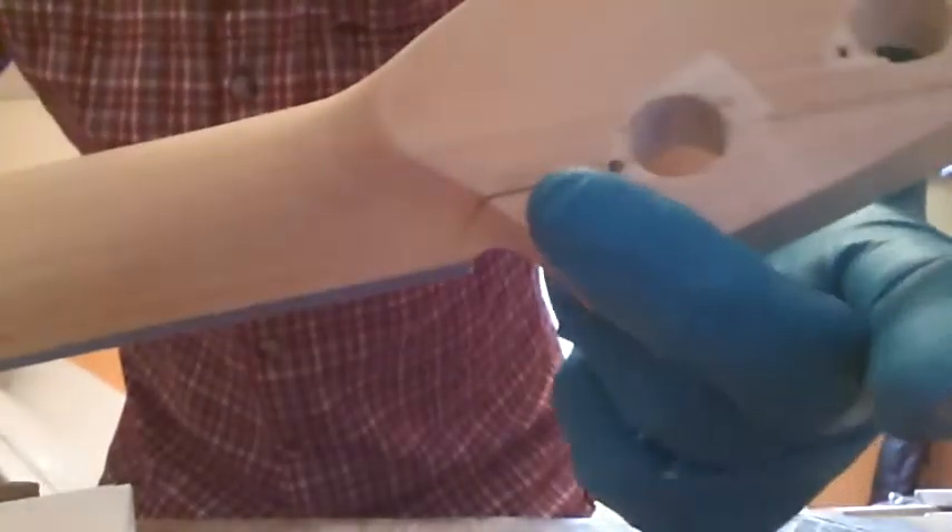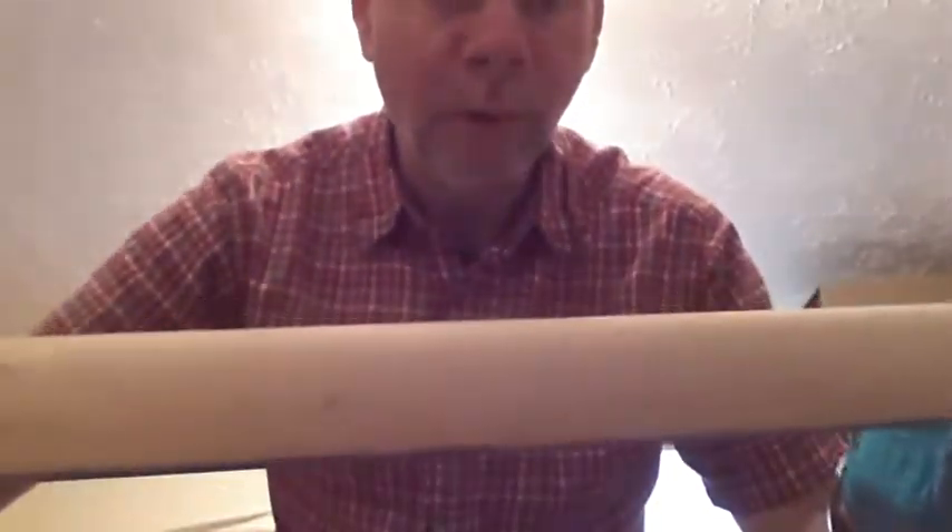The observant among you will notice the massive dink where the wood is split - I fixed that with epoxy, but it's very tricky to hide the scar line. A proud battle scar! According to the bottle instructions: apply, leave until tacky, wipe off the excess, then leave to cure for two to four hours before applying the next coat. I'll give it the maximum four hours.